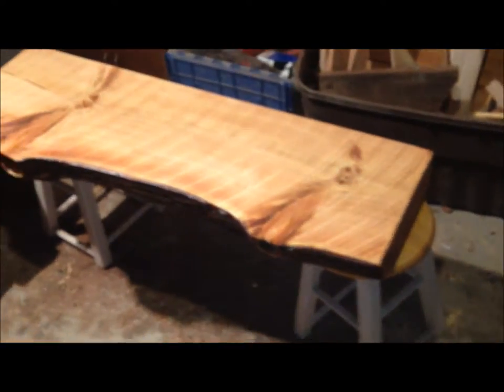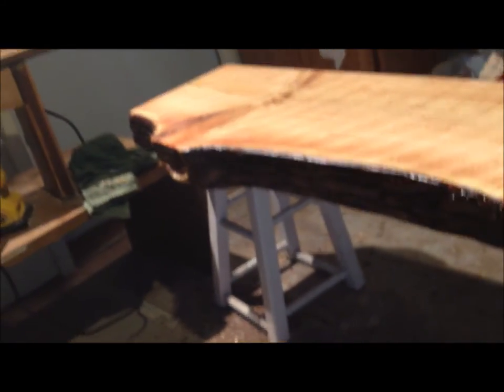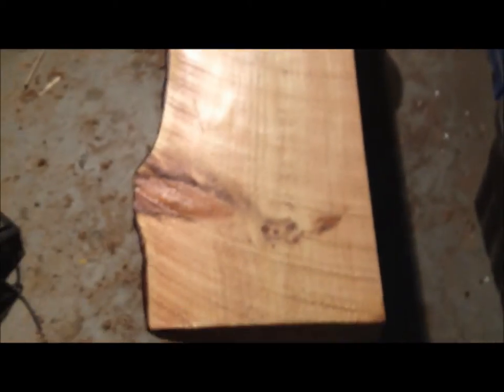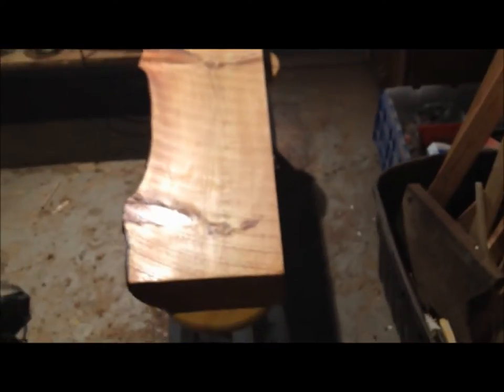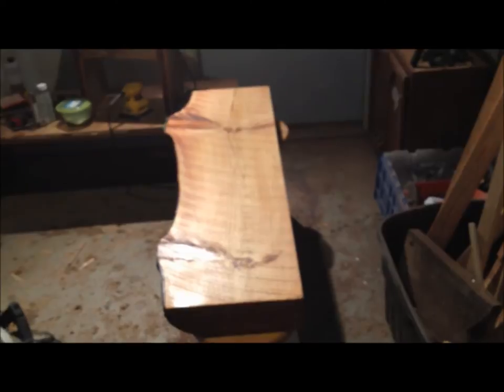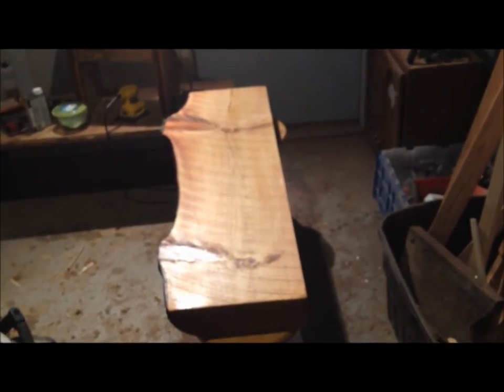I just added Danish finishing oil — it definitely brought out the knots and made the wood nice and shiny. The only thing is it's showing these circular marks, which must be from the saw. I've sanded and sanded this — I think I need a different type of sander or to put it through a planer. Either way, I'm going to keep it like this for my first one. Worst case it comes out bad, I'll just flip it to the side.